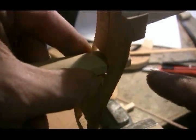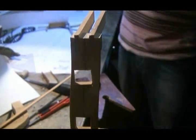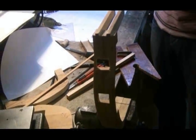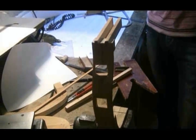We must take in mind that in this position the sides are not under the right angle to the horizontal line. It is curved. The surface is very difficult, not simple. And our shablon will penetrate through this gun port hole not very easily. We must be careful with marking. We must take in the mind that the surface of the board is not vertical to the keel. And we must put the shablon horizontal to the waterline, not perpendicular to the board.